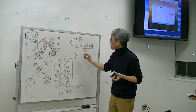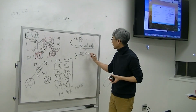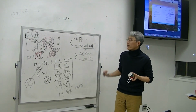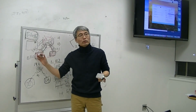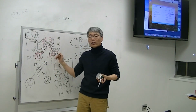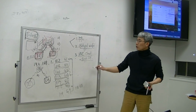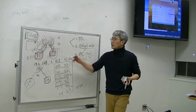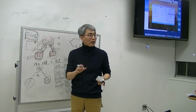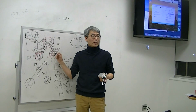So once you complete the VNC, the server is a cloud connection, at that time you need to sign in. Then whenever you turn on your Raspberry Pi under a pre-connected Wi-Fi, anywhere you are you are able to connect. Okay? Later, if you want to do your project, you can set this up, for example with a hotspot. Turn on the hotspot and connect to the hotspot, and then your friend uses the same Wi-Fi for the laptop. Then you are able to connect.